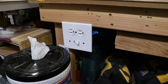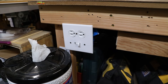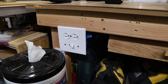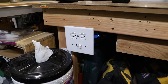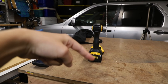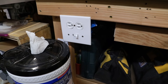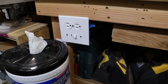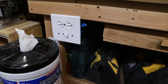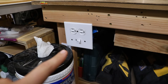It's wired up with an old 12-gauge, 15-amp extension cord that I had a short section of. I just cable-stapled it to all the 2x4s and ran it down into the box on the other side of the workbench. That line runs through an electrical box I wired when I set up my shop — it powers my table saw and miter saw in a dual-gang box. I also just plugged this in there with one of those plug connectors you wire up yourself. Super handy — I think you should do it too.